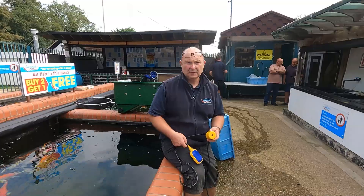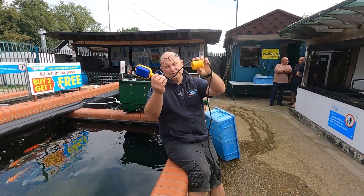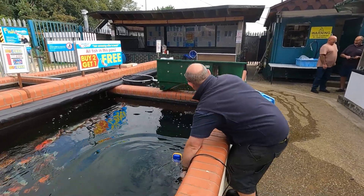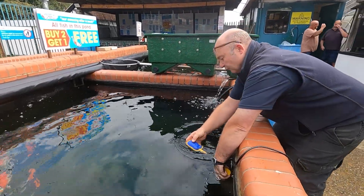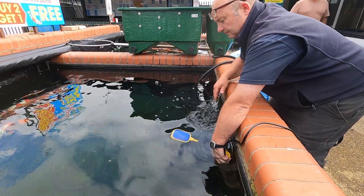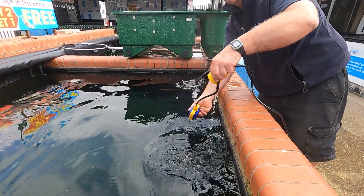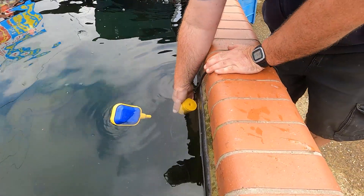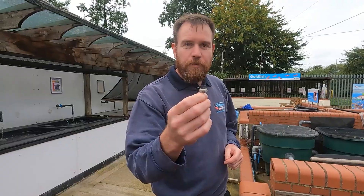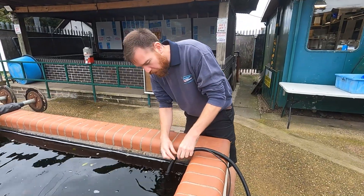If you're not 100% sure about how to wire this thing up, this handy diagram is going to help. All you need to do is connect this weight onto it — what this weight does is cause it to sink into your pond, the power comes on, and as the water level drops the switch will disengage the power and your pump will stop. Up is on and down is off. At the side of the pond you need to hold the cable — use a clip to hold it, or you could just cable-tie it to the hose.